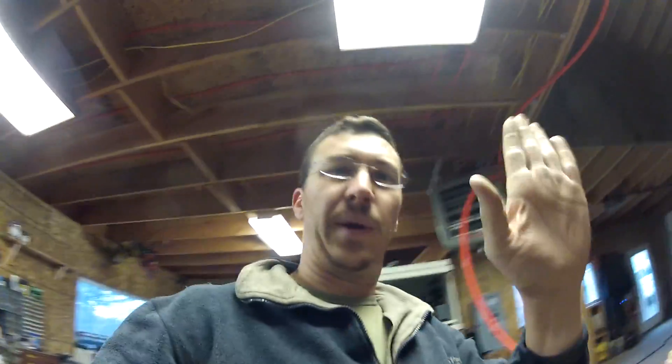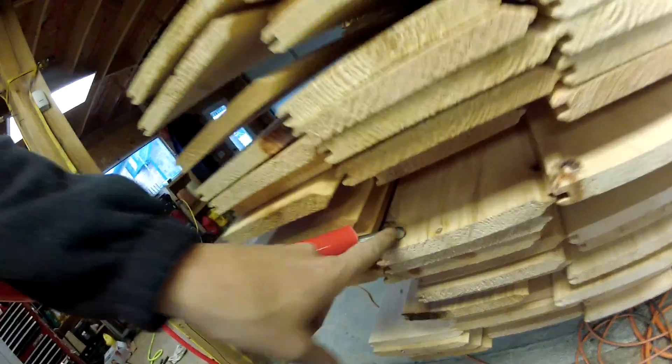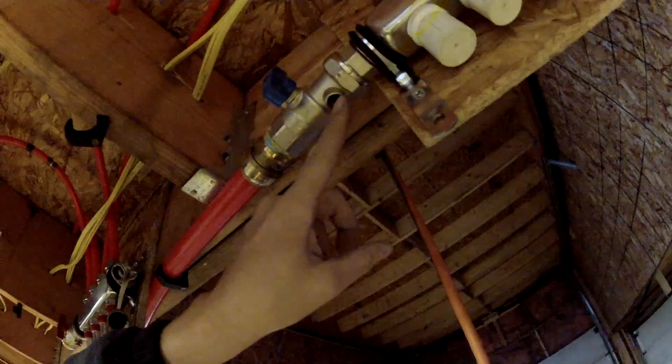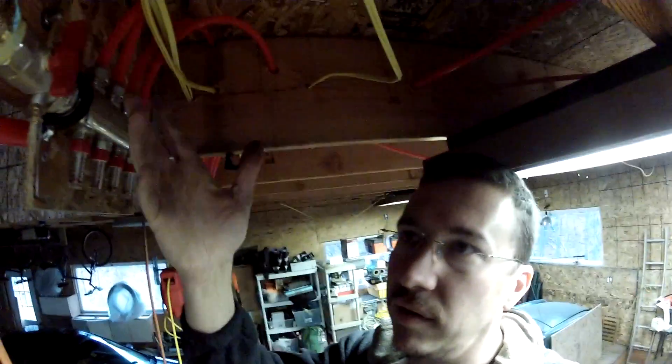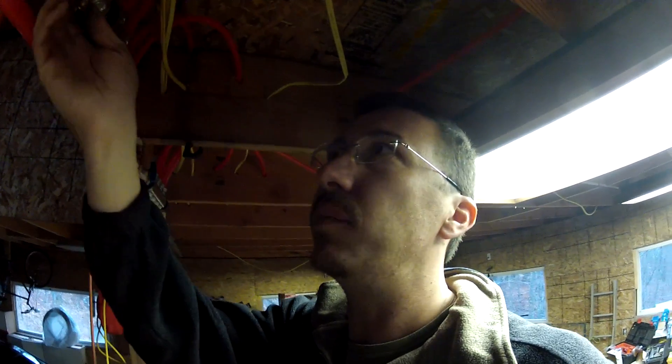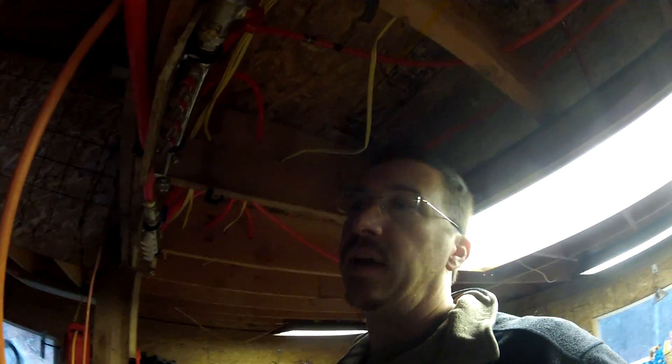Okay, more tips and tricks. The curve at the end of these PEX pipes is wicked. So what I'm doing on this one is I put a metal rod inside, which keeps it nice and straight. If I leave that while I'm working on this, hopefully it'll straighten it into line. Also, these things have a little temperature gauge that goes in here. Take it out when you are working around this stuff because I broke one. So I use a broken one now for pressure testing so I don't break another one. When you order your manifold, order another temperature gauge — they're wicked cheap, they're a buck. If you break one, you'll have it. If you don't break it, you'll have an extra.